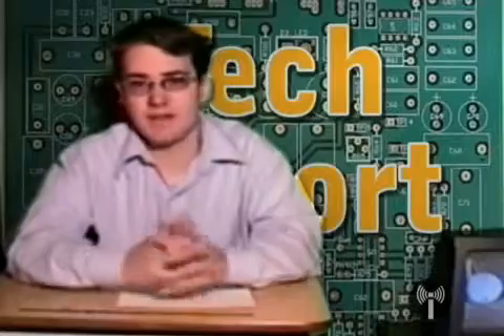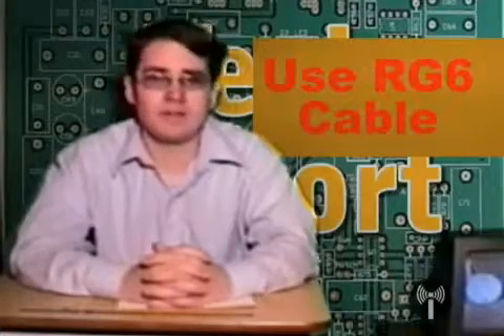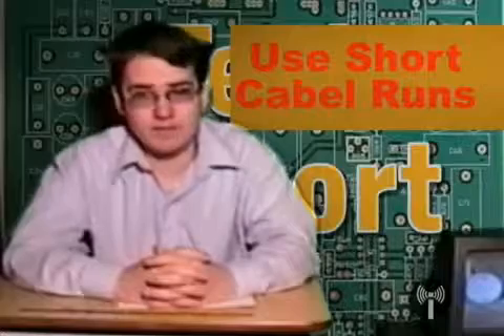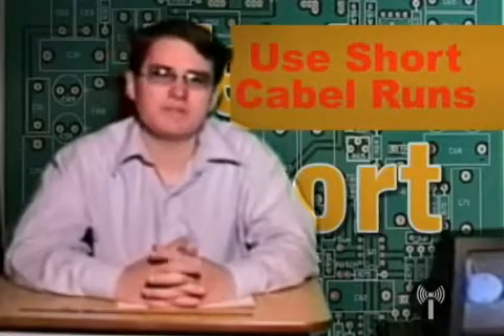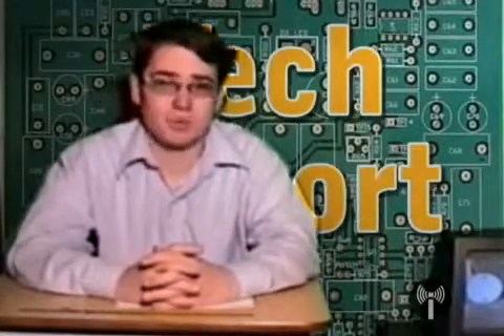The second part of your free-to-air system is the coaxial cable. It's essentially a standard cable TV cable but higher quality. You put connectors on either end, feed it through the mast assembly on your dish, and plug it into your LNBF; on the other end it goes into your receiver. You want to use high-quality coaxial cable — RG6 or above — because anything less won't allow effective signal transfer or pass power to the LNBF. Also, make your cable run as short as possible, because longer runs mean more signal loss, which can cause you to lose reception during inclement or cloudy weather. Use common sense: high-quality cable, keep the run discreet and short.